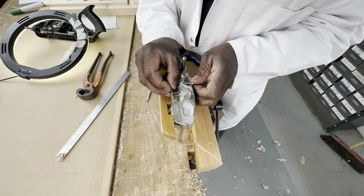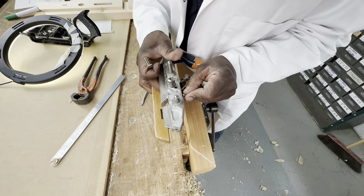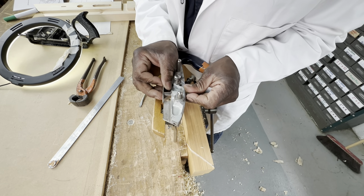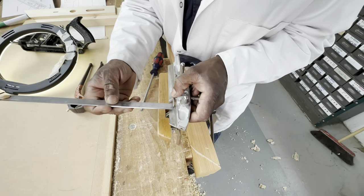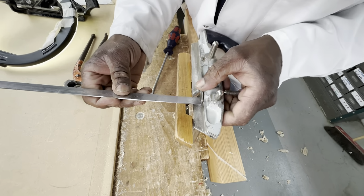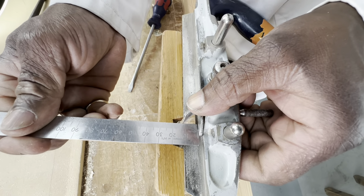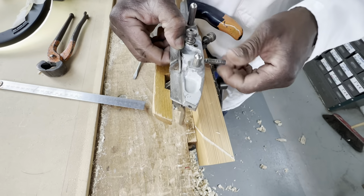But there's a bushing side. I'm going to show you what I mean. The bushing here, so this needs to be pressed. Oh, here we are. There's the plastic bush. This sets into that, like so. And then I'm going to pick up my ruler and just from here, from the depth stop, measure 12 mil. There's 12 mil to the tip of the blade. So there's the tip of the blade there. I'm gonna rest it on top of there like that. Okay, so now I'm gonna hold that there and just thread this through.